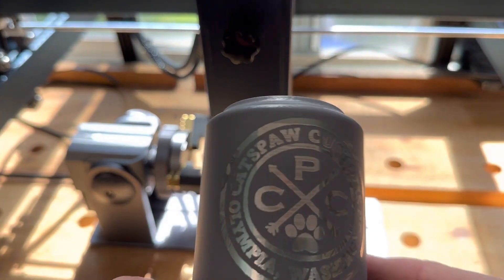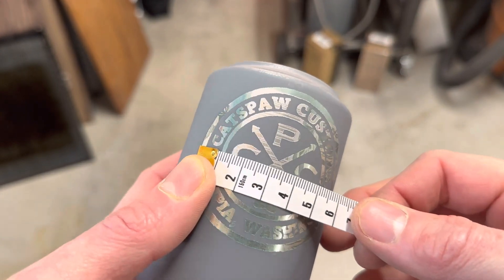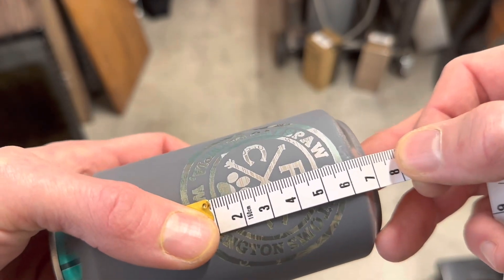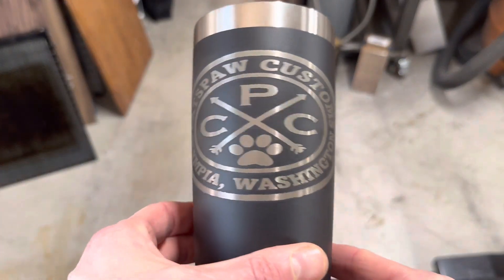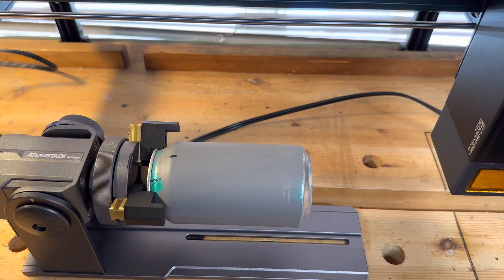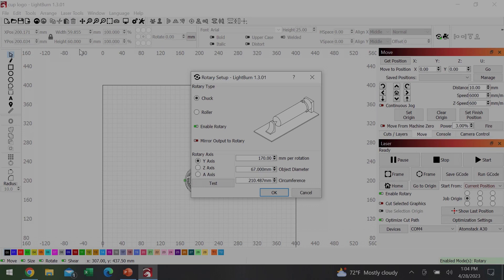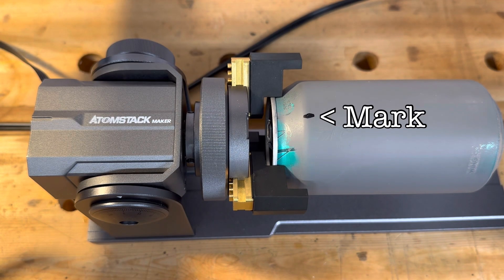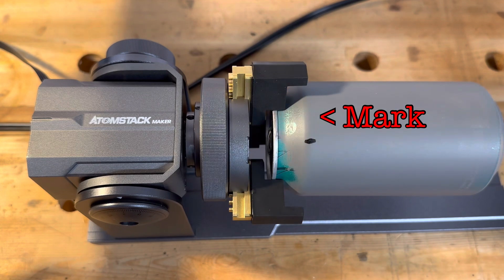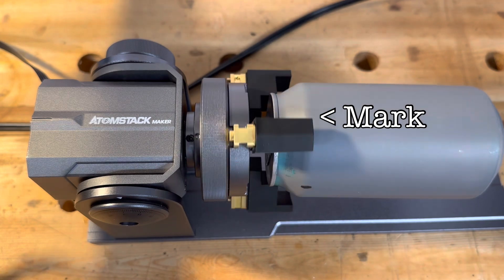When the engraving had finished it looked good, but I want to show you a curious thing. This logo was supposed to be exactly 60mm by 60mm, but when I measured it across I saw it was 65mm, while the top and bottom was 60mm as expected. I was actually recreating something I had already found out the hard way — my logo on a previous cup went on extremely elongated, like an oval that somebody had sat on. So here's how to fix that. On this can I made a reference mark at its uppermost point, went back to the rotary setup menu, and clicked the little test button. This runs the chuck through its full travel based on the millimeters of rotation setting in Lightburn. And as you can see, the chuck was over-rotating.